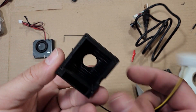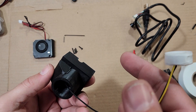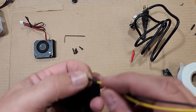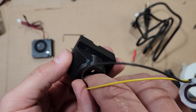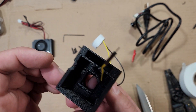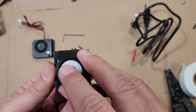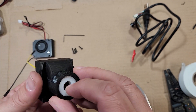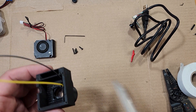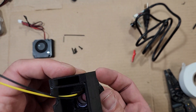The next challenge is to put this light ring inside the camera housing. You'll see there's a little hole at about seven o'clock and you've got to run the wire through it. This might seem like an easy task for some, but for those of us who have huge sausage fingers this can be quite challenging. As I pull this through I didn't do a good job of aligning the notch with that hole, so I'm going to rotate the camera body so that the notch in the bottom of the light ring is aligned with that hole. I'll use my trusty do-it-all tool and rotate it just a little bit so it's aligned — this helps keep our wires nice and straight.